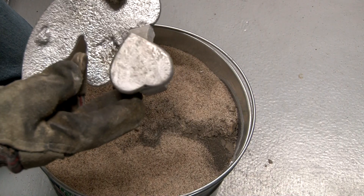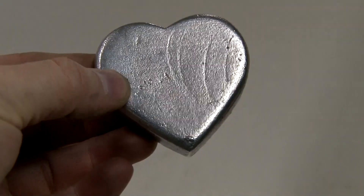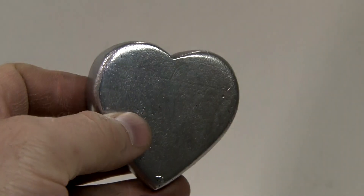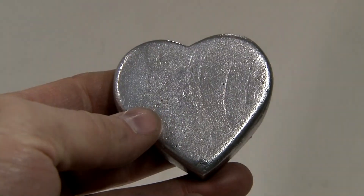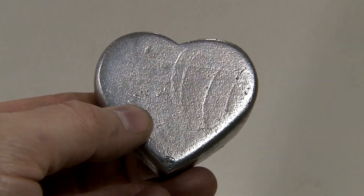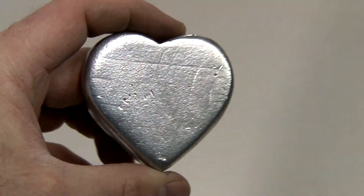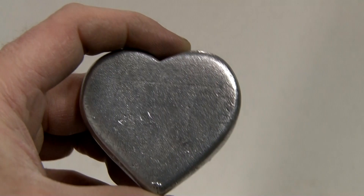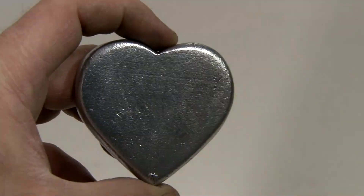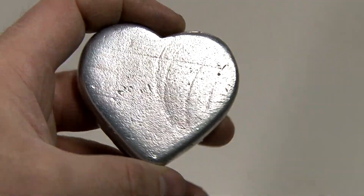This will give you an idea of how well this reproduced. The only part I sanded was the back of it on a belt sander after I cut off the sprue — the rest of the surface has just been polished on a buffing wheel, and that was to preserve the defects and everything that happened from the foam to the actual casting. A lot of detail came through; a lot of imperfections that were on the styrofoam showed up in the casting, but I think it pretty much turned out well. If I'd spent more time on the styrofoam it probably would have turned out even better. I'm pretty impressed with how well it reproduced — it's my first lost foam casting and I think it turned out pretty well. If you did too, give me a thumbs up, check out my other videos, and don't be afraid to subscribe. Thanks again, hope you enjoyed the video.